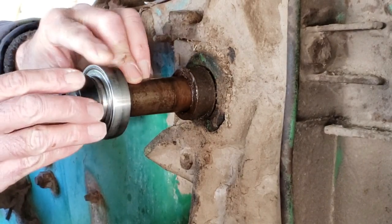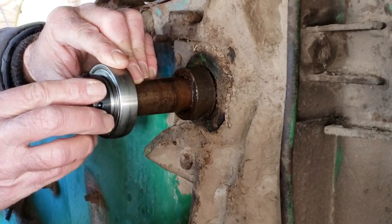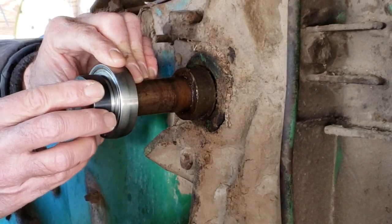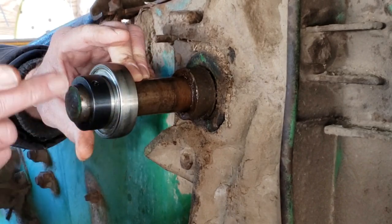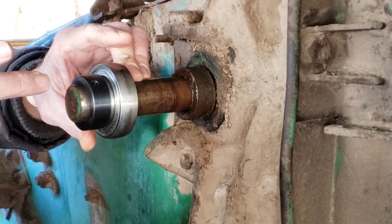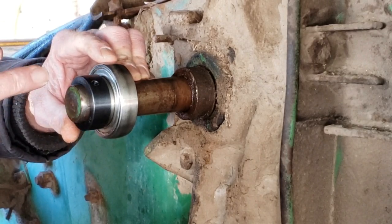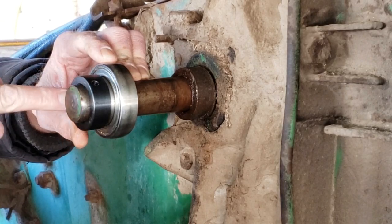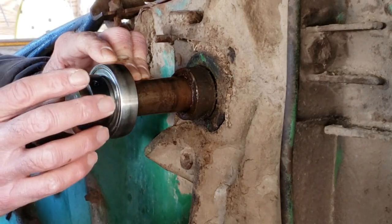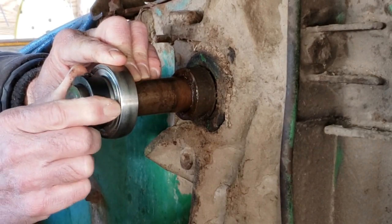You take this and slide it on and it mates up right there where it dropped in. Now I want to turn it that way — it would lock, I feel the resistance on it. But I'm going to rotate the whole thing this way. Since this thing is turning that way in normal operation, the bearing is going to be turning that way. And if there's ever resistance built up inside of the bearing, it's going to want to take the inside race and cause it to turn counterclockwise. So I want to lock this thing by turning that locking collar that way.